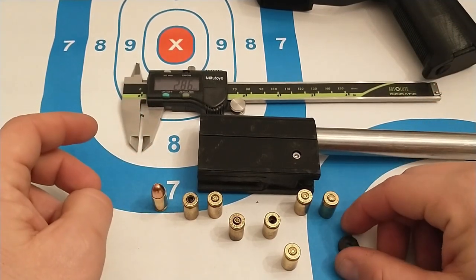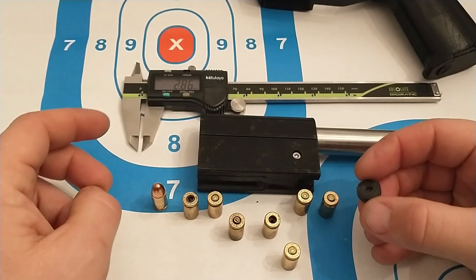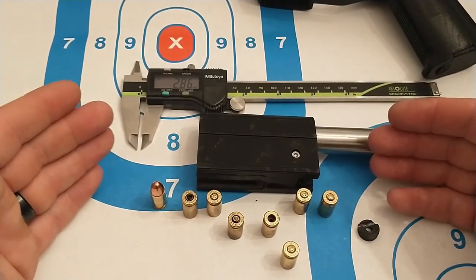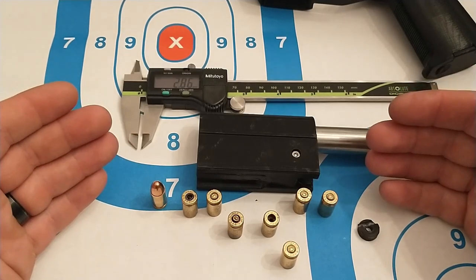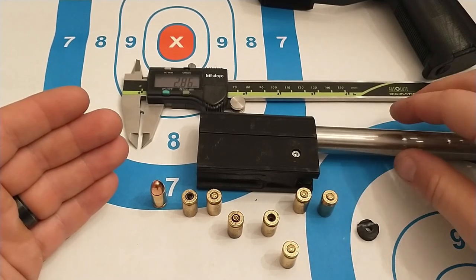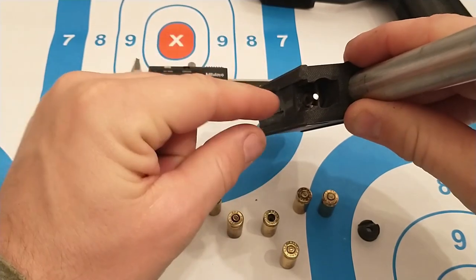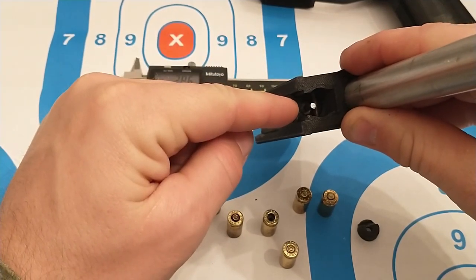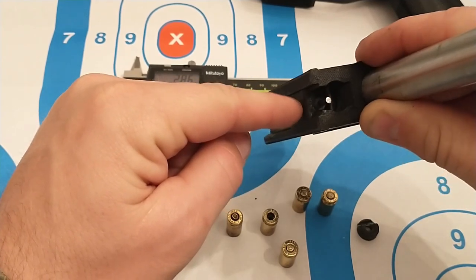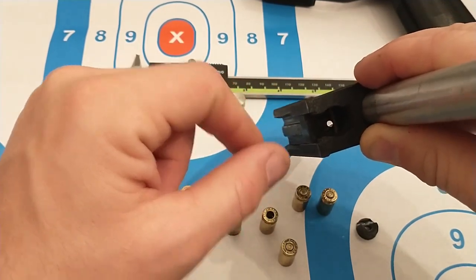Also when I was firing, I saw that a piece of my firing pin retention insert came out, and I was thinking I better stop and go home. My firing pin is loose within my receiver and if I continue it's just going to get bent and I'll have to make a new one. But what ended up happening is it stayed in there, and where it broke off, it stayed in front of the firing pin retention screw and it guides the firing pin so that it does interact with that screw and stays in there.